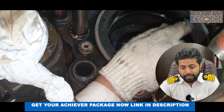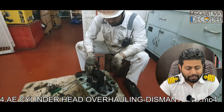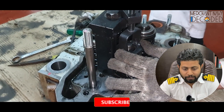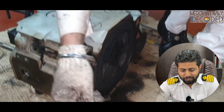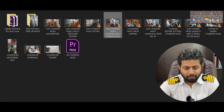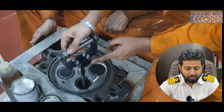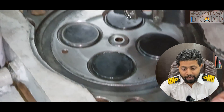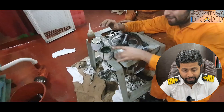I am removing all the important gaskets and O-rings and explaining them. Now for generator cylinder head overhauling — the cylinder head has been removed and dismantled. I am removing the cotter pins and showing the stem seals. These are the exhaust valves in burnt condition — this is how a cylinder head looks, you need to clean it, lap it, and make it look good. I am carrying out cylinder head valve lapping; the oiler on board shares his experience on how lapping is carried out and why it is important. Two kinds of lapping paste are used — one very fine and one coarse.